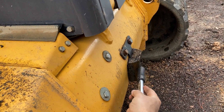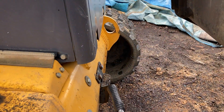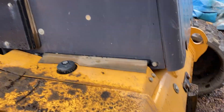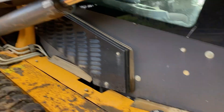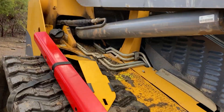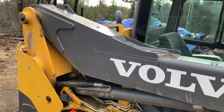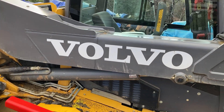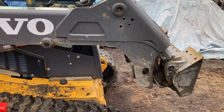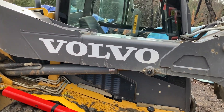Down here we have the resting bumper, which is adjustable, so you can rest the mechanism against it and push using the undercarriage instead of relying on the joints. This machine is a radial lift, which is great for pushing because of that feature — the ability to push from the undercarriage instead of relying on the pins. Vertical machines are nice for other reasons but have more joints, which means more maintenance. In my situation, I prefer a radial machine because I need to push stuff and I'm not filling up dump trucks. The radial lift is perfect for me, and they usually cost less money.